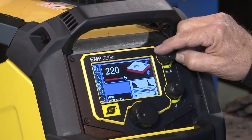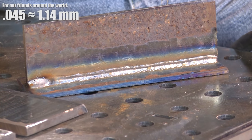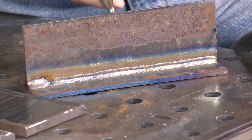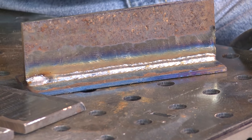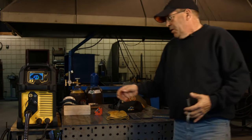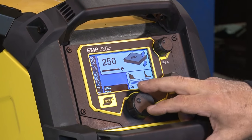This particular weld I'm looking at is the .045 S-MIG with C25 gas — 75% argon, 25% CO2. So I'm thinking, if it doesn't try to bump itself over up into the spray, whatever's going to happen, I'm thinking it might come out pretty close to this. And then I want to step over and change this back over to straight MIG.